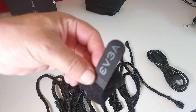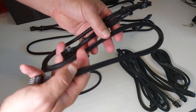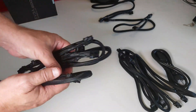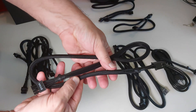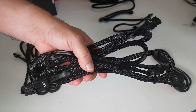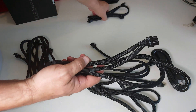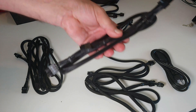If you wanted to plug in six GPUs into a mining rig, you could use three of the cables with six-plus-two splitters — three cables with two connectors each gives you six risers powered. Then you could use the one-to-one cables with splitters: four of those would power four cards with two eight-pin inputs each. That leaves two cables where you can use eight-pin splitters to power GPUs five and six, giving you six GPUs each with two eight-pin connectors.